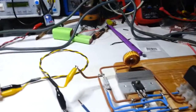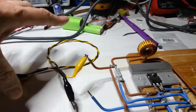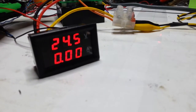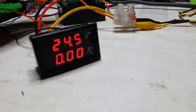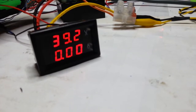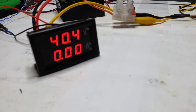And I've got a thermal fuse. My thermal fuse are these wires here. They do get quite warm, especially as I've had it up at slightly higher voltage. I'm going to turn this back up to 36 volts. But I was actually going to go to 40. But I don't want to break my flyback. I thought it was broken, but I don't want to break it. So just while that's there, I'm just going to see what sort of current this draws.